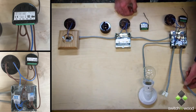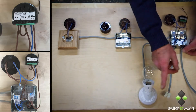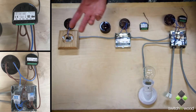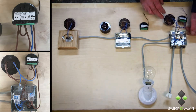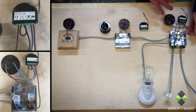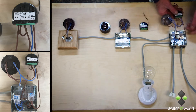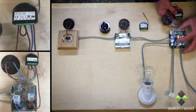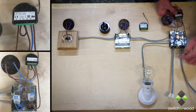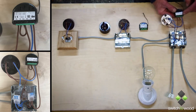OK, we'll start at the beginning. This is our cable in here from the consumer unit and this is the cable that will go on to subsequent lighting circuits. This one here clearly goes to your lamps — could be a series of GU10s in your kitchen ceiling. And these here are the wires that link three switches in this case; it could be just one, it could go on to four or five. From your consumer unit, the live comes into a connector block and back out to your next circuit, and you take a live link to the dimming pack to the terminal marked L.